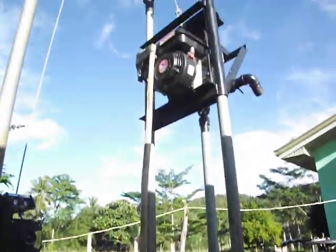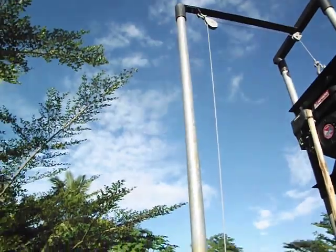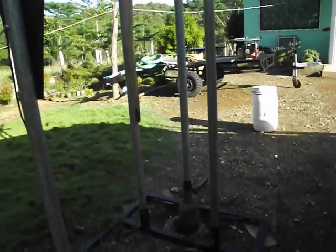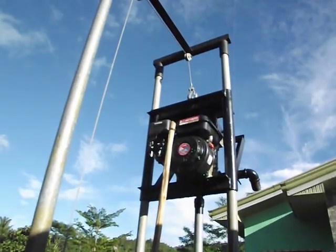There is a proper name for it — I can't remember what they actually put in with the water, but I've never needed it here. So the drill is quite clogged up now with clay, but that's a demonstration of it working. We were drilling five, six feet an hour until we hit rock, and then it was a slow process — you have to be very careful chewing through it. It does go through but it slows you down quite a bit. But it's got plenty of power — I went through it quite easily. It's only a seven horsepower motor.